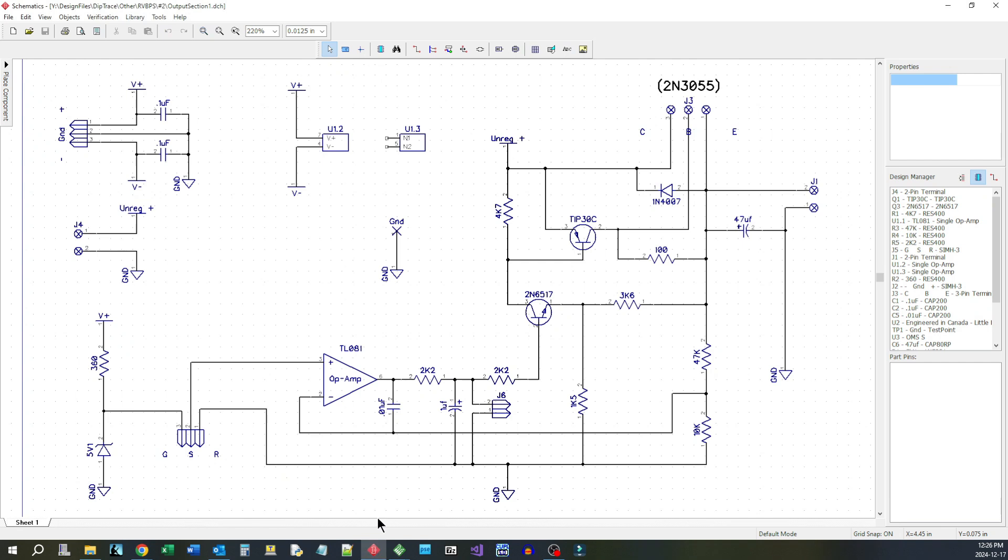So I'm taking a different approach with this one. We're going to first work on the output section or the voltage control section, and this is going to be regulated — just by itself it would be a useful power supply. I've taken the op-amp and I'm running it off its own supply, probably plus or minus 12 volts, which would be fine for most op-amps. In this case I'm going to use a TL081. We've got a little voltage reference here coming off the already regulated plus 12 supply — the zener diode is going to be a pretty good voltage reference.